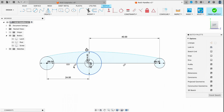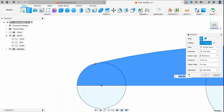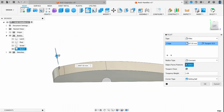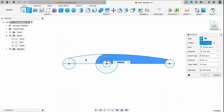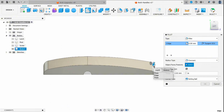When I design, I sometimes like to work in a symmetrical mode where I'll design just half of the part, do all my featuring on that single half, and then mirror the part later — it saves time on applying features to both sides. To do that, I'll take the line tool and cut each of these circles in half. I'll select all the profiles for the top half. If I include the slivers and fillet it out, it comes out with a slight bow, so instead I'll undo that, select all profiles without the slivers, which creates a sharp point at each edge. Now when I fillet it out, it will fillet an outside edge instead of that inside edge — a much cleaner result.